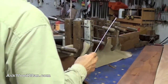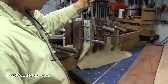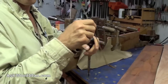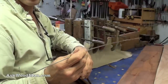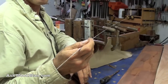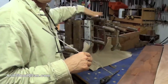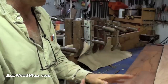Here's the structural repair on that board. I used a big screwdriver to hold the board apart while it was clamped at one end so I could flex and open it up. Here's the insert out of a windshield wiper blade — the reason I don't use wood is because wood can break off when you jam it way down in there and then the joint won't close right. I jammed it all the way in, worked glue everywhere, put masking paper on it, and put all these hand screws on it to fortify that joint. With so much cross-grain gluing I'm not worried one bit about the structure.